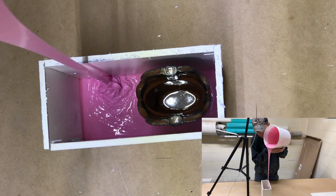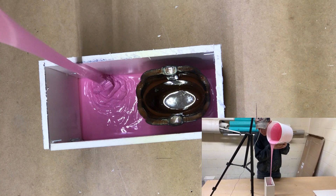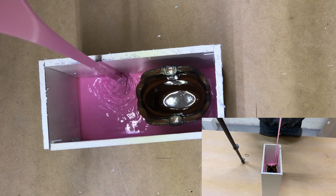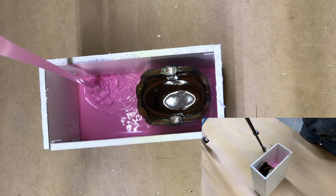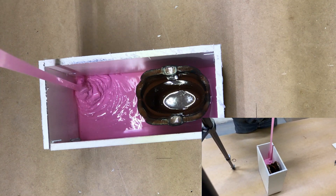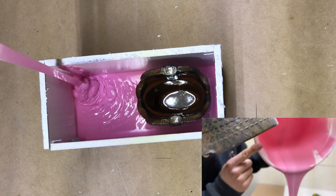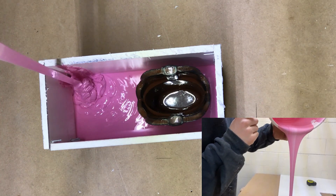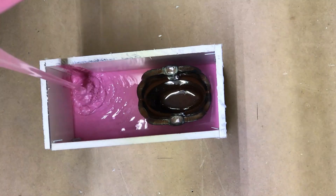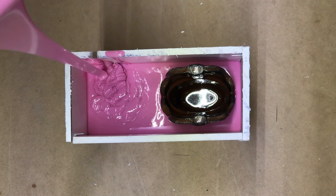If you see any of the materials in this video there will be links below in the description — if you can't find them locally you can have them shipped to you. As you can see he's pouring a little faster now, and you can do that as it starts creeping up, but you really want to be careful when it's running around and up on the piece so you don't trap air against the actual sculpture in the mold.